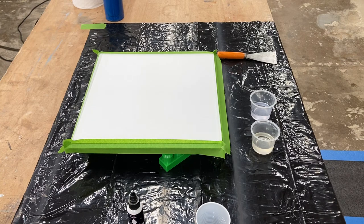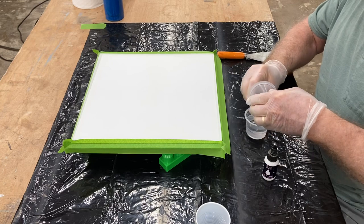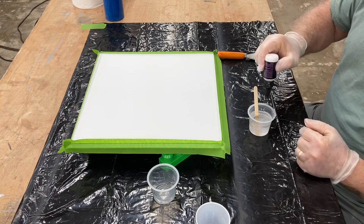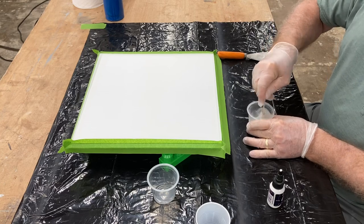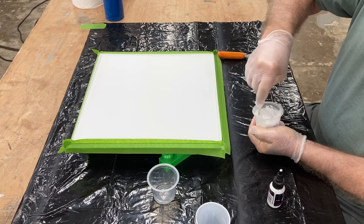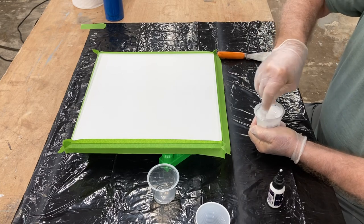The paint's all dry. I put the frog tape around the perimeter - that wasn't completely necessary, but I wanted good control of the epoxy on the surface. The white color I'm using is from Stone Coat Countertop. I only take just a couple of drops; a little bit goes a long way. This whole process does not need to be rushed - you have about 45 minutes of working time with this epoxy. After adding the color, I'm thoroughly mixing it for at least two minutes, scraping the sides of the container, making sure everything is completely mixed before putting it onto the project.